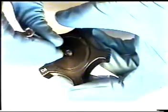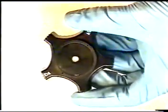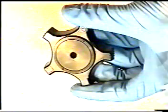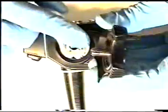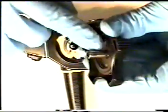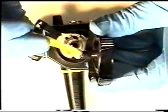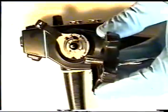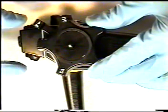It will take a little doing. You might need your small screwdriver to fit it back into the slot at the top of the knob. Reinstall the up-down knob back onto the shaft. Be sure there is no debris on the up-down shaft. You can use your paintbrush with white lithium grease to clean off any debris. Slide your up-down knob onto the shaft with the up-down letters pointing towards the head of the instrument.